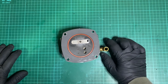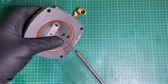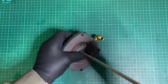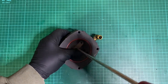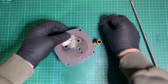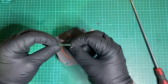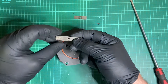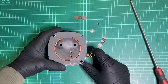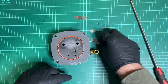So hopefully now under some better light you can see the damage to the valve there. It's just a single screw holding it in, so you just get a screwdriver in there and slacken that off. There are several bits to this: the shims, a small square one there, a spring, and the main spring steel valve. There was a small bit broken off and it was jammed in there, but I've got rid of that now. I must admit I have taken this apart before I shot this video, and that's what sort of gave me the idea for the content.